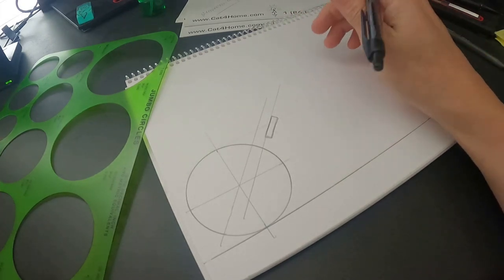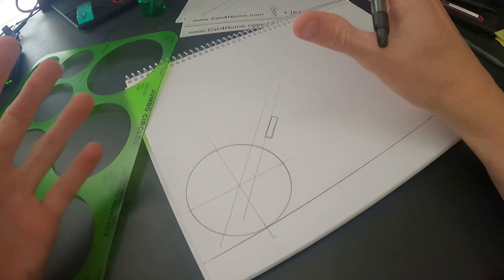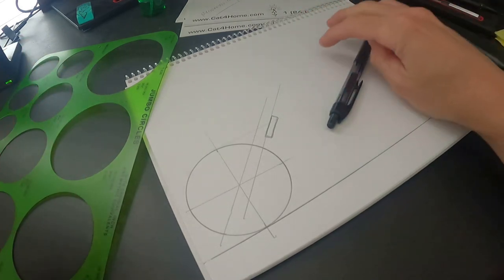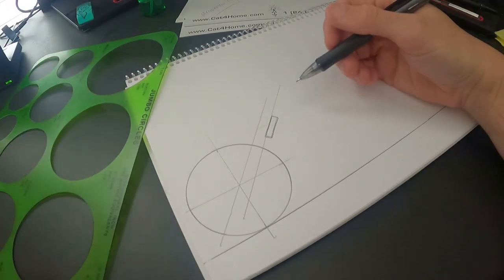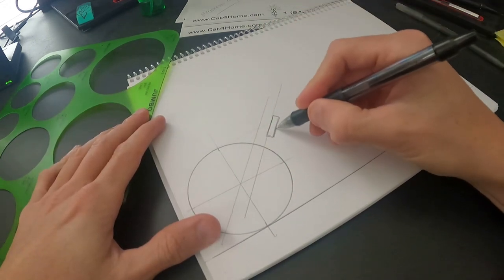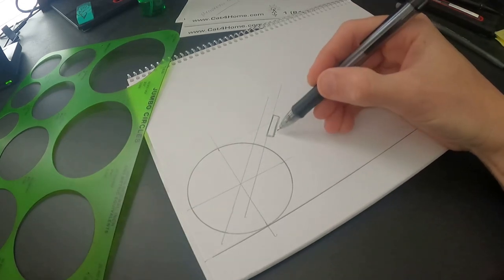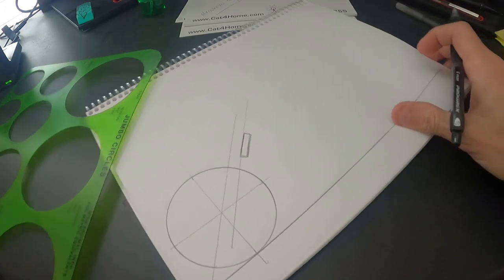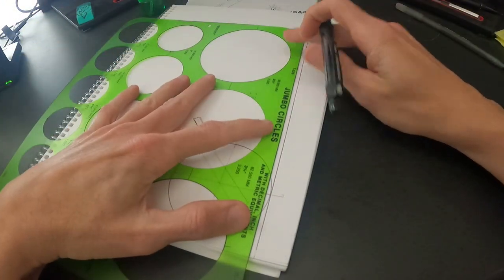A lot of people ask me what the rake is, and honestly I built one frame that seemed to work perfectly, then set my table up to that frame and welded that area — so every time I put down my head tubes, that's just what comes up. Here's where you figure out: do you want your frame to be more of a cow digger with that front point, or do you want your frame to come down and turn?